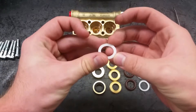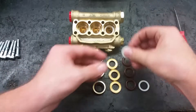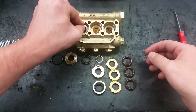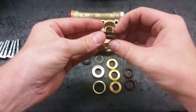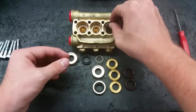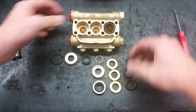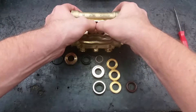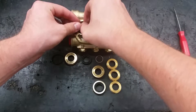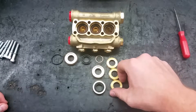The first item to be replaced are the support rings. They go in the pump flat side down. On top of that should go the high pressure seals — its curved side should fit over the support ring. Next, comes the front piston guide with its curved side down.